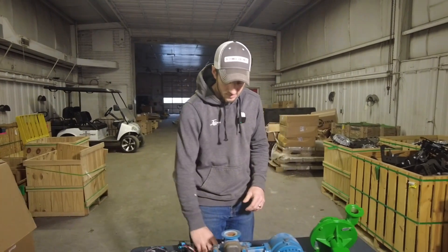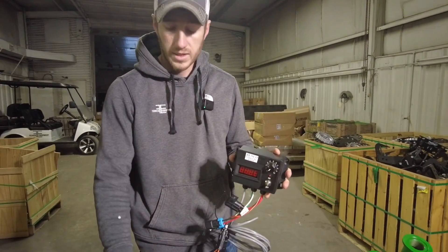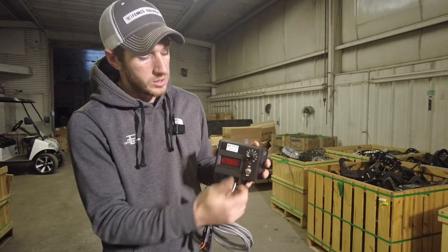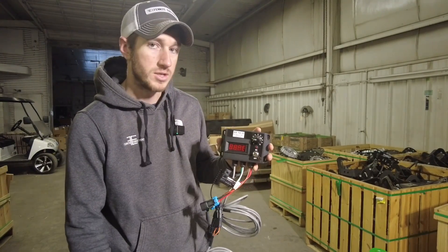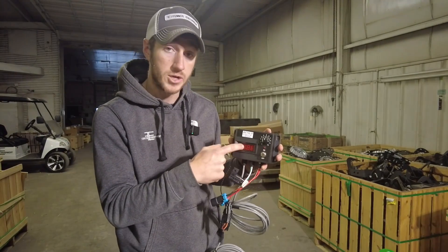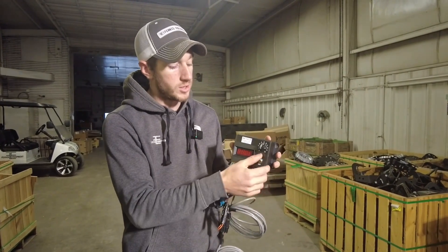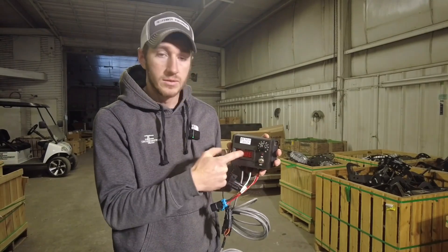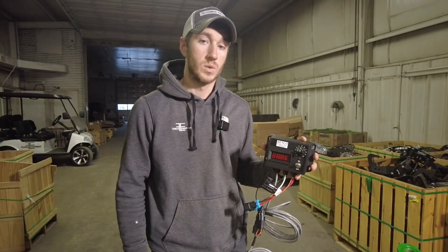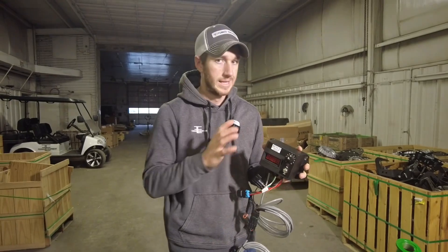What I really love about these electric pumps is their ease of use. They are so simple — anyone can run them and they are extremely reliable. With an electric pump, I use two different types of controllers. This is what we call the Benco motor driver. You simply turn it on and this controller pushes amperage to the pump. You increase or decrease the amperage until we match our desired pressure. When we're choosing our orifices, we choose them based on a pressure — say 30 psi. You turn your switch on and turn this dial until the screen reads 30 psi. At that time we know we are achieving our true and actual rate. It's got a whisker switch on it: when you raise your planter it stops, when you lower it, it turns back on.